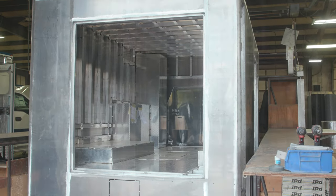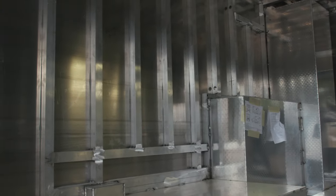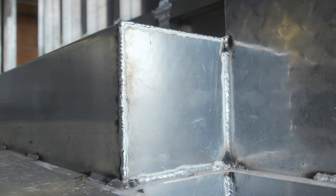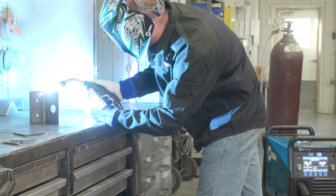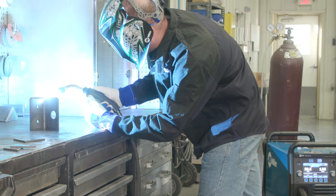With the 355 you can adjust every flow of your wire, every flow of your gas, and it's a versatile machine able to easily switch between aluminum and steel. The PulseMIG process lets you weld at much higher amperages and have less distortion in the metal and put less heat in it, but still be able to weld very thick metal.